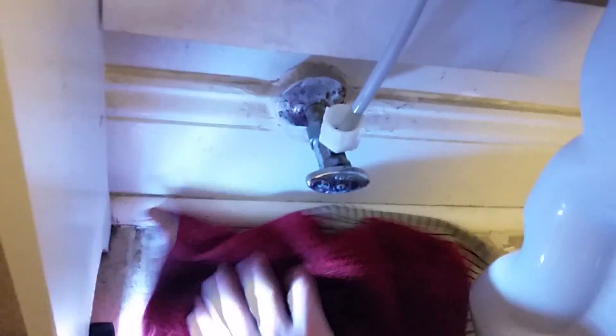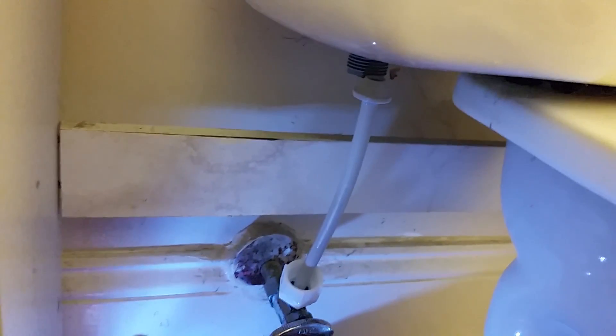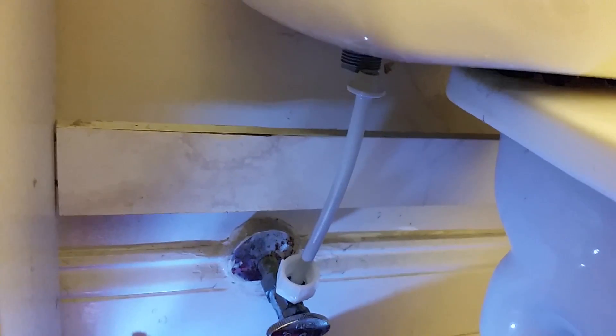Well folks, just as a tip — probably wise to flush the toilet first. As you can see I made quite a mess down here because I disconnected everything, turned off the water, and went to pull this out and water started pouring everywhere. I realized that with the water off you flush the toilet first, you empty the tank, and therefore don't make nearly as much of a mess. So just a reminder to those folks. This is the part I've got to get rid of — my replacement part is for that, one that's flexible.